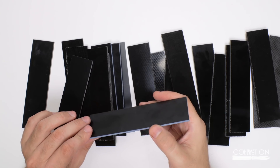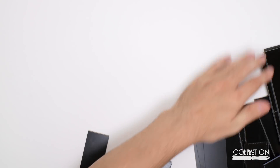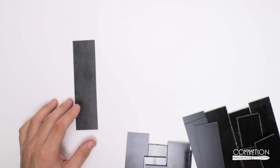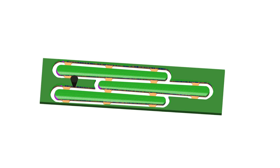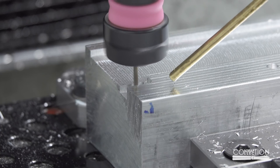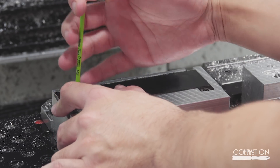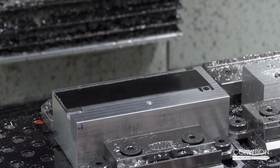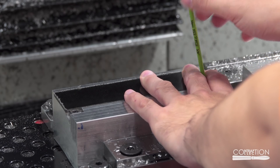I think this is G10. G10 uses glass fiber cloth, so it's kind of in between carbon fiber and micarta. I heard it can wear out tools fast so I don't want to use it right away, but it would still be a good choice for handle scales. I chose different cloth types of micarta but I don't know if you'll be able to tell them apart — I should have got different colors. I wanted to try making the scales in a single operation, so I made a simple fixture designed to use pitbulls, because I didn't want an additional operation of drilling holes and I didn't want to make some kind of custom clamp myself. I think this was a bit of a mistake. I could tell the pitbulls weren't holding very well and were delaminating the bottom layers, but I realized I could raise the pitbulls up with washers and grab closer to the center of the stock. This felt much better so I decided to give it a try.